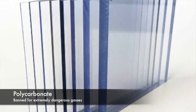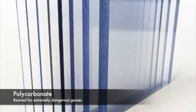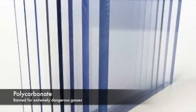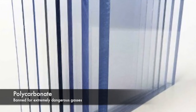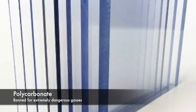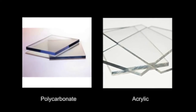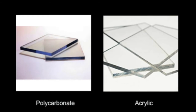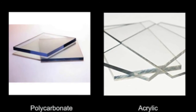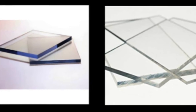The second material banned from use is polycarbonate. This material is very similar to acrylic, which can be confusing and why it is so high on our list. The material is clear, has a rigid plastic-like nature, but can be very deadly if used in our laser. There is almost no visual way to tell the difference between polycarbonate or acrylic, and the dangers of this material are the most common reason why you may be turned away with any other clear material that is not known to be acrylic or glass.